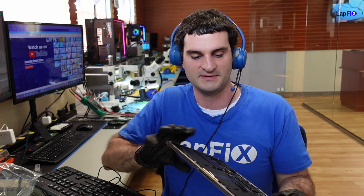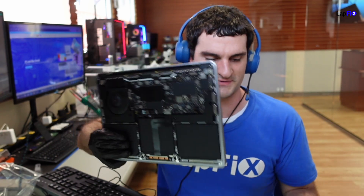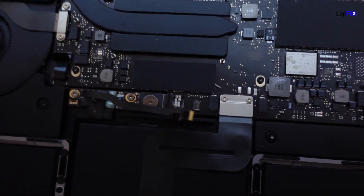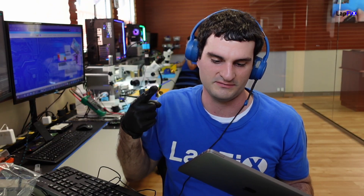Now this one's a little bit interesting. It's in here for repair. It actually came in something like this, and we noticed this right away. The back cover doesn't have screws on it, and it looks like there's corrosion on the board. And you see the battery connection is actually lifted off there — if we look really carefully, it looks like the latch of the battery connection is actually broken off. So it looks like there's two problems now: we have a liquid spill, and we also have a problem with the latch.